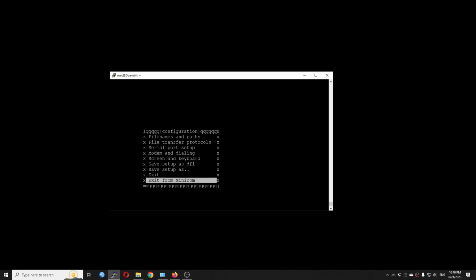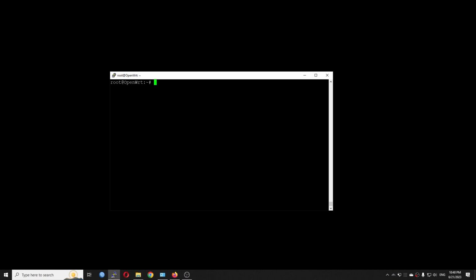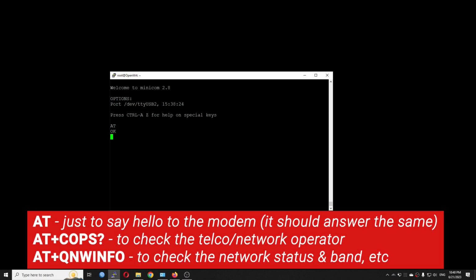So now I'm going to exit from minicom and hit enter. Now let's connect to the modem again by just typing minicom. And very good, we are in. So let's run AT just to say hello to the modem, and yes, we got the response. So next, let's try AT+COPS? to check if we have a network connection or not. And right here it says that we have the telco, which is Mobifone, which is one of the telcos in Vietnam, and it says that the connection is good.